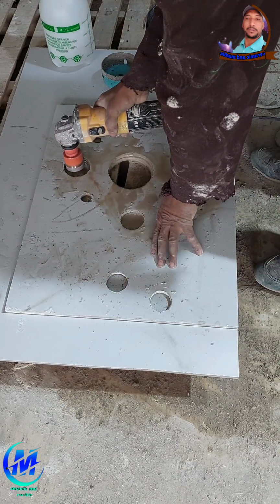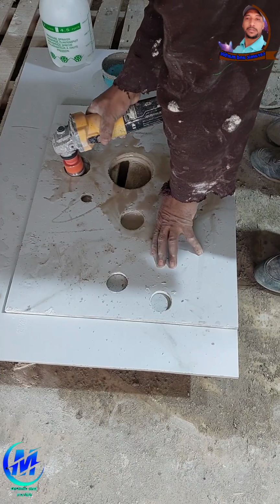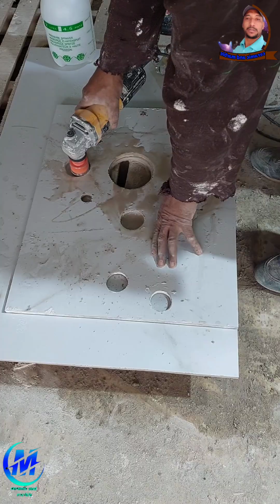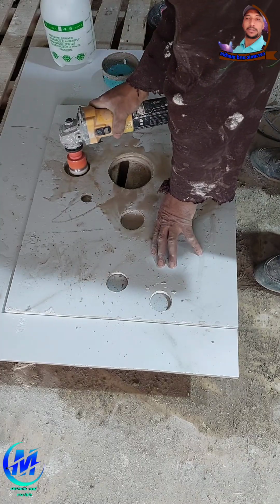Make sure you leave a small gap for expansion so tiles don't crack with temperature changes. Avoid placing small slivers of tile in corners. Instead, shift your layout if needed to keep tiles as full as possible.